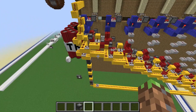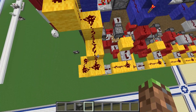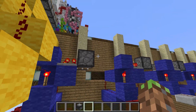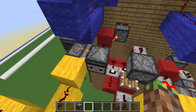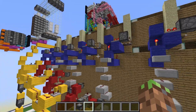The yellow circuit is the reset circuit. When you push the reset button, it first retracts a piston so the carry mechanism doesn't accidentally activate all the double piston extenders. Then it extends and retracts through all of them, and that's how the reset works.